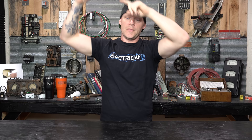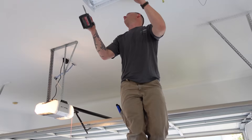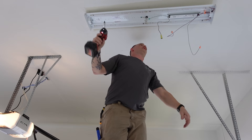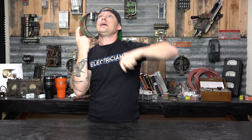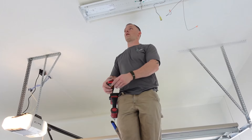The cool thing is when the fixture is hanging down from the ceiling, it gives you access above it to mess with the wires before it's fully secured. Then I take my drill and start on one end — I pull down on the fixture and push up on the drill to keep tension on the toggle bolt head above the sheetrock. If you just push up, the thing will spin on you. You have to keep equal tension until it gets tight. Then go to the other side and do the same thing.